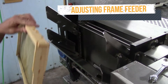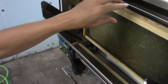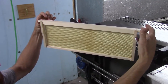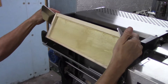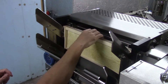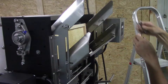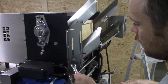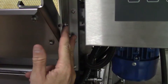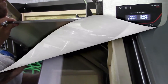Before trying to uncap any honey, it's best to use some new frames to make adjustments. The first adjustment to the uncapper is to set it for the proper size frame. In this case, we will extract all of our medium frames first, and then later adjust it and extract all of our deep frames from our deep supers. Put a medium frame on the uncapper rails and adjust the lower guide upward until it touches the bottom bar of the frame. This keeps the frames vertical as they enter the uncapper.